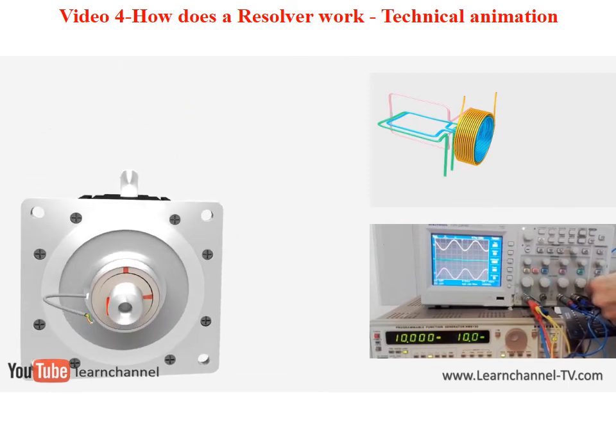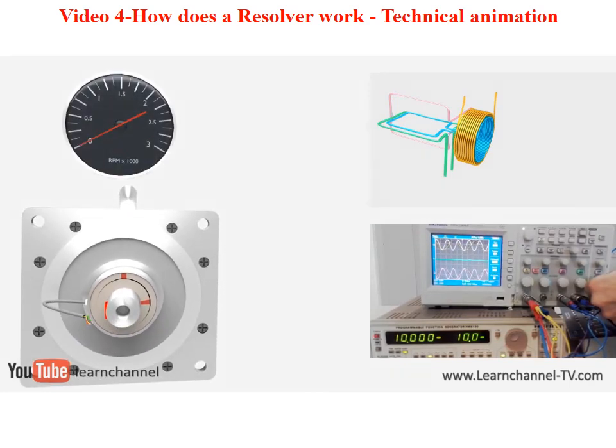So, let's change the time base of our oscilloscope and watch the measuring signals. What you see now is that you get a modulated sine and cosine measuring signal, which are also called the envelope curve. It's now up to the resolver digital converter, RDC, to evaluate the current rotor position and the rotational speed from these signal curves.